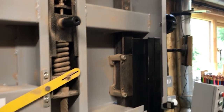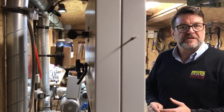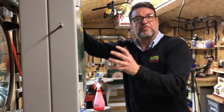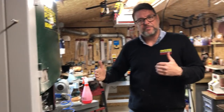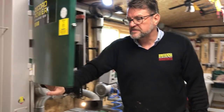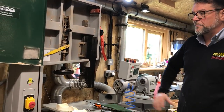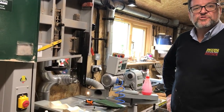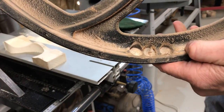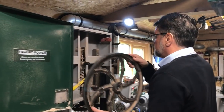It's a nice solid frame with a double spine, which means you're actually tensioning the blade and not the machine frame. On cheaper models there's no strength in the frame and as you tension the blade you pull the frame together, causing vibration and bouncing. With the double spine, plenty of torque, and cast iron wheels, this is the largest one in the Record Power family before you step up to a Startrite, which has thicker gauge material, heavier wheels, and industrial motors. The wheels at the back also have balancing weights like a clutch plate, so the wheel runs true with a nice smooth rotation.